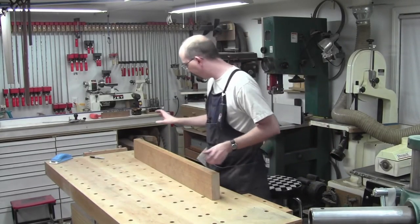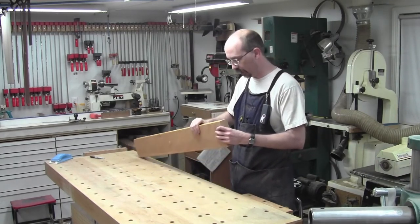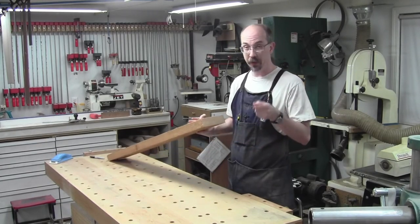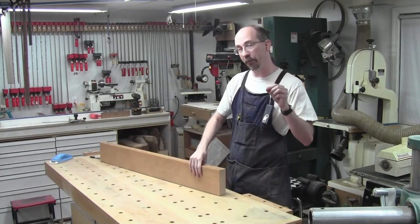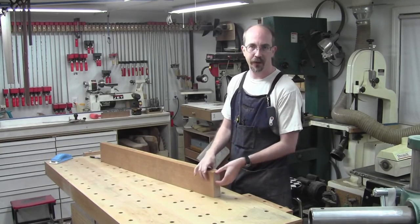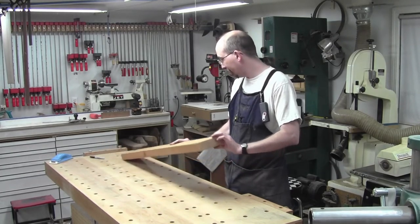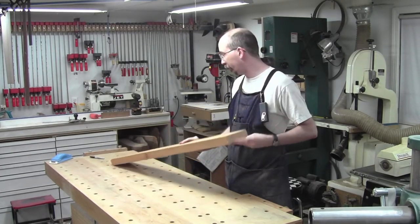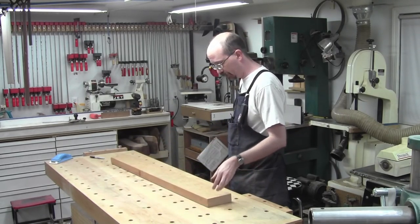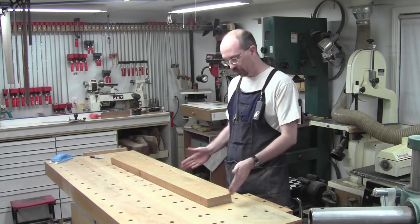It's really light too, but that's probably because I'm used to walnut and maple and heavy stuff. What I've done is I've taken the rough measurements of this board — it's rough stock, rough on all sides — and I went into SketchUp and drew each of the bracing pieces I need, and did a cut plan for maximizing my yield, because this is the only bit of good spruce I've got and it'll take me a while to find more.